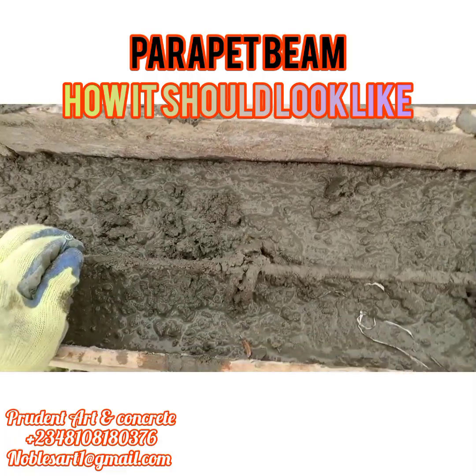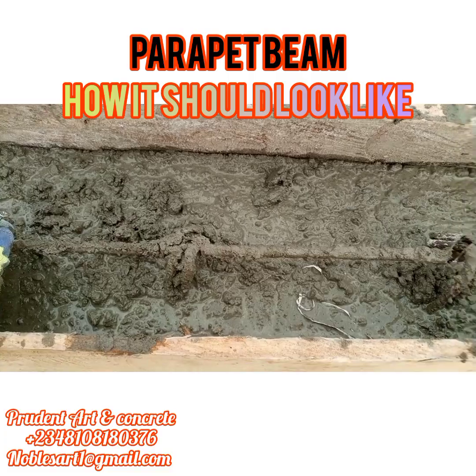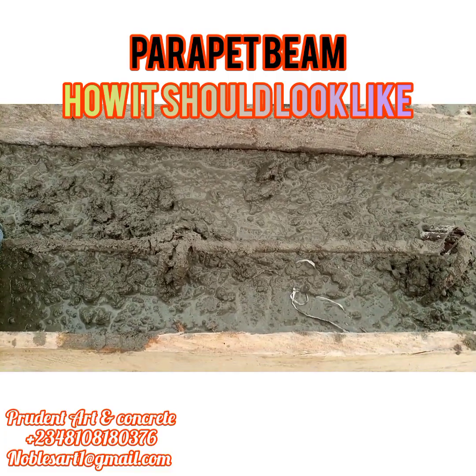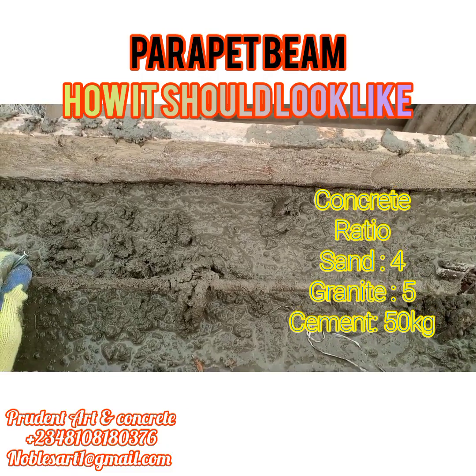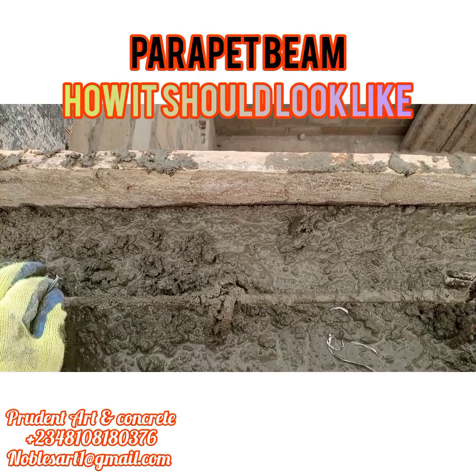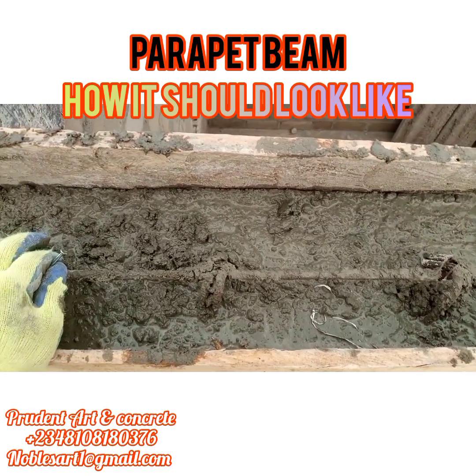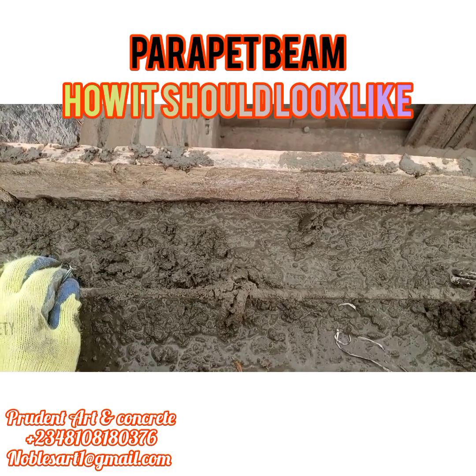Please make sure your concrete is very pure. The ratio we use: both the aggregate, sand, and cement is nine head pan total — five head pan of stone and four head pan of sand per 50 kg cement. When casting, make it very pure so that it will be solid enough to carry the fixture you wanted to use.